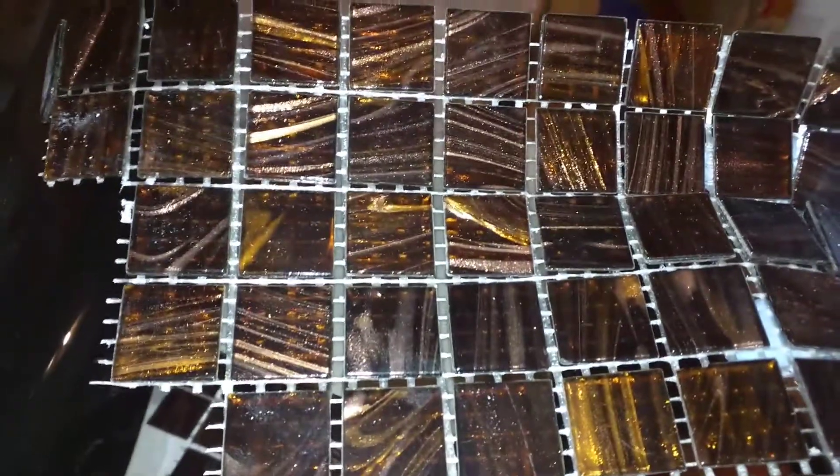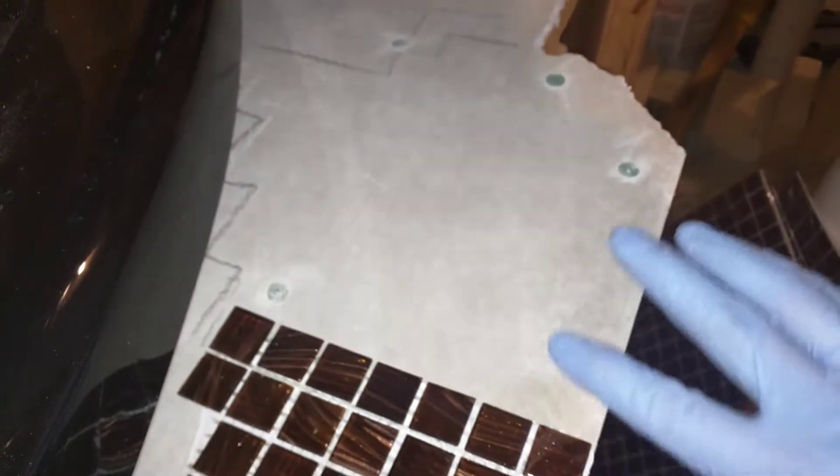I got this kind of tile, it's actually really nice looking. We are going to put it on this concrete board. I already got this concrete board screwed down every four inches or so. I got this bathtub actually jacked up with the car jack.